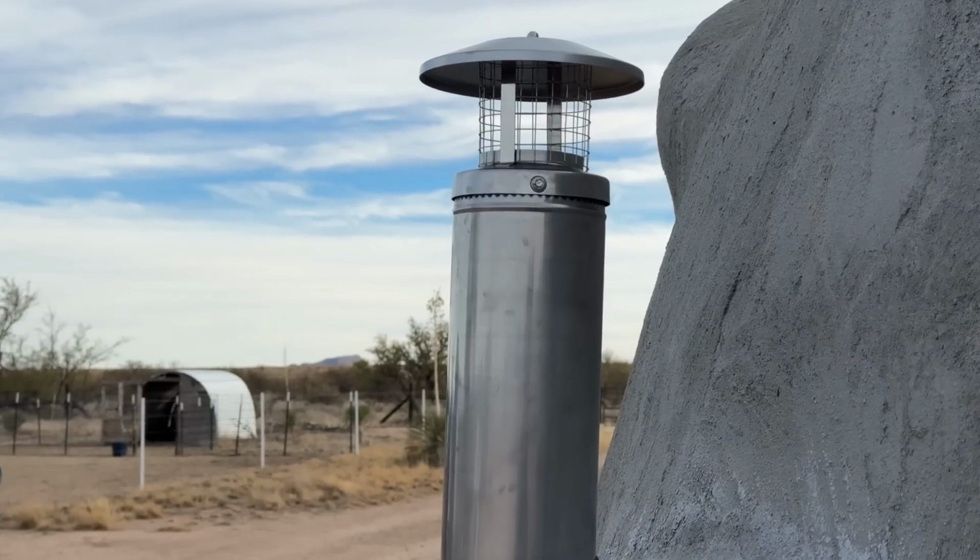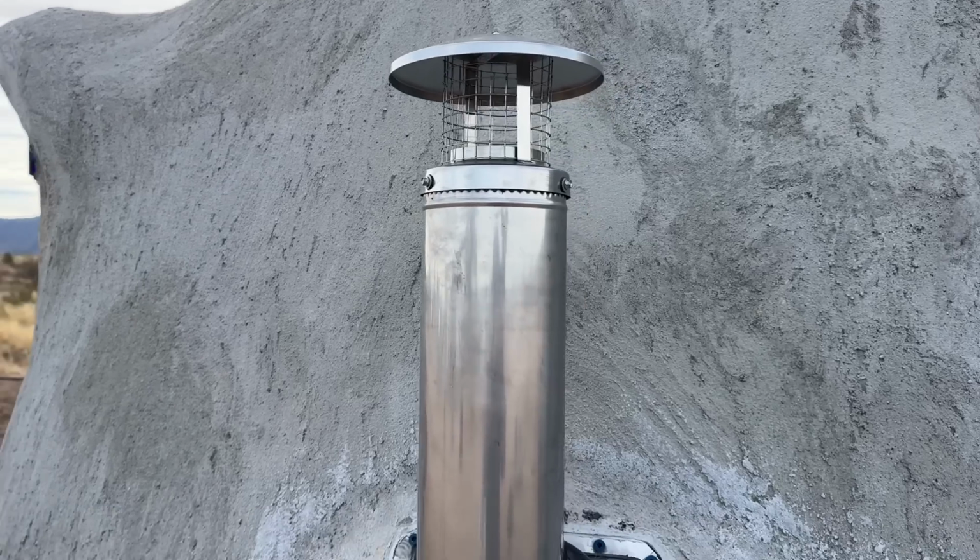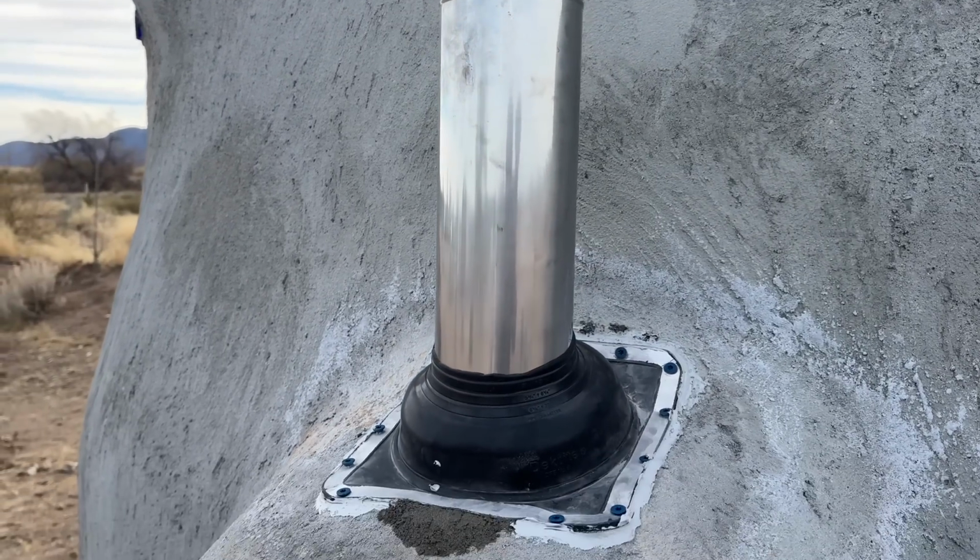Even though we got it screwed in all the way around, we still had to put a bunch of caulk underneath that seal and then build up the stucco, because it wasn't perfectly flat. It was all handmade. We plan on coming back in the next video when we do the elastomeric, and we're going to paint all around that and get it all nicely sealed in. We were a little worried about this, but it turned out a lot better than I thought. Yep.